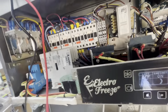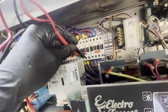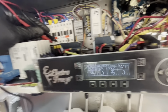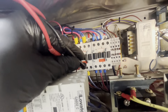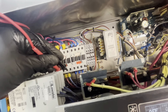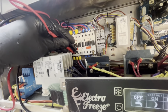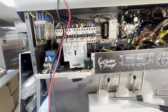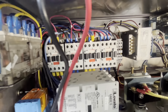So I just tested voltage in and out of that unit, and it's fine, it's 206. But when she just kicked out, so when it kicks back on in a second, when I touch this, I swear I hear the contactor buzz. We're getting good three phase out, 206. Let's wait for it to fire back up again, put the thermal on it, watch how hot it's getting.